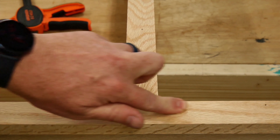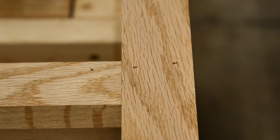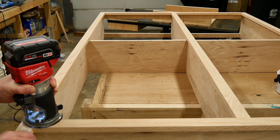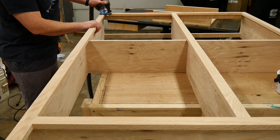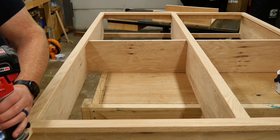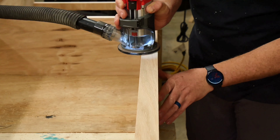I used a tiny bit of wood filler to fill in all the nail holes. I let it all dry and then even though I didn't film it, I sanded all the spots flush. Next, I got out the router and put an eighth-inch roundover on all the face frame trim strips. Even though this part wasn't completely necessary, it was a nice way to soften all the edges and give it a more finished appearance.